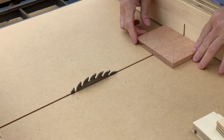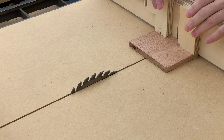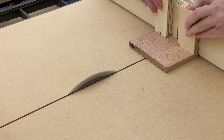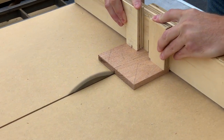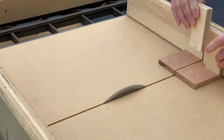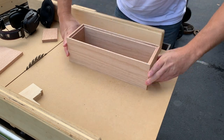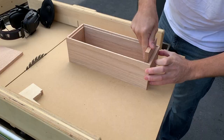The support for the neck was going to be the full width of the box with a V cut into the middle end. The support for the body was going to be little 45 degree wedges — or isosceles right triangles for you math nerds — that would get glued into the bottom corners. I attempted a dry fit to see how well I sized the neck support. It was a little too wide, so I trimmed it up.